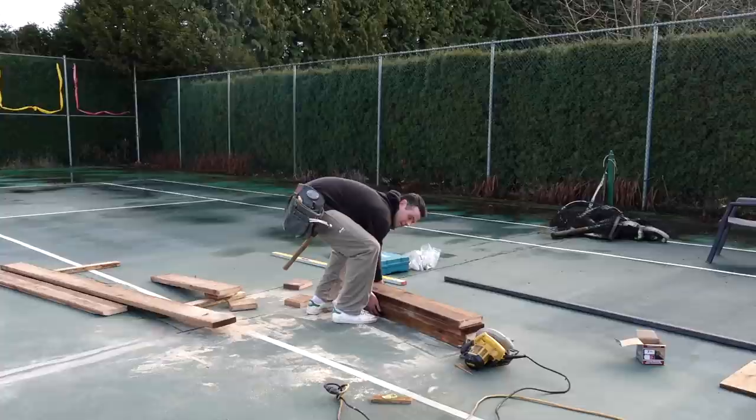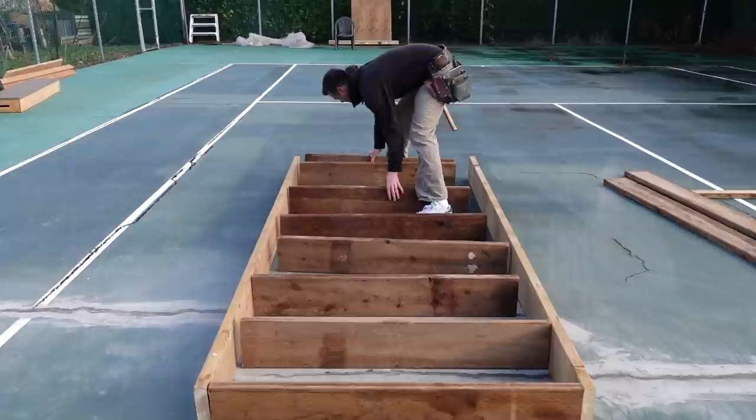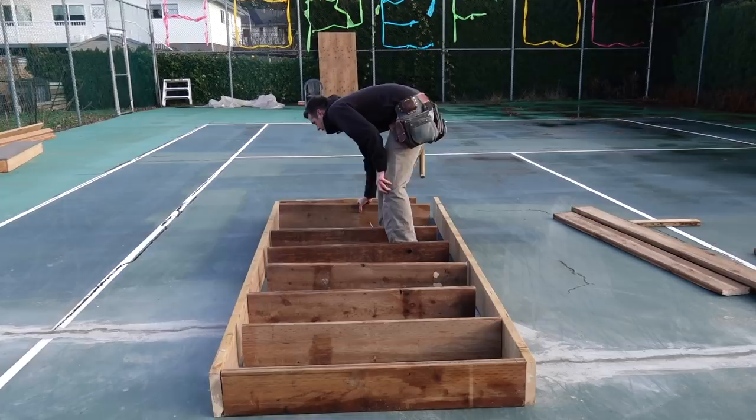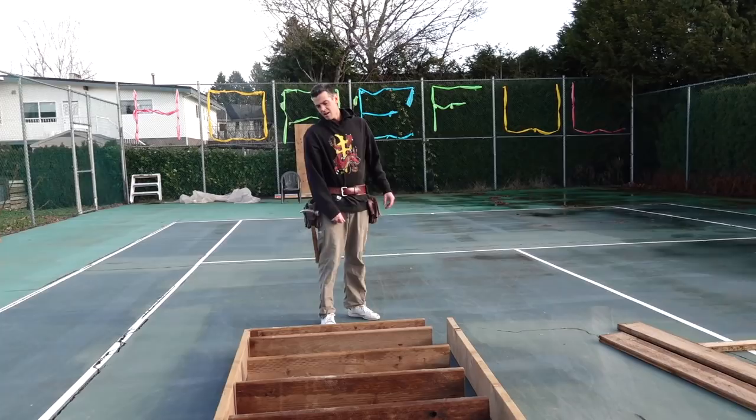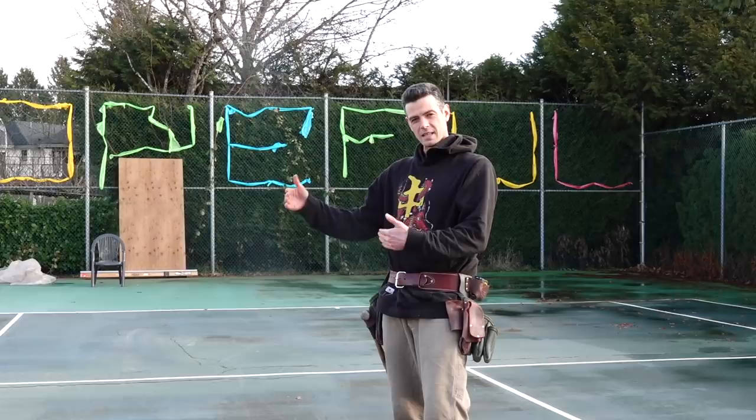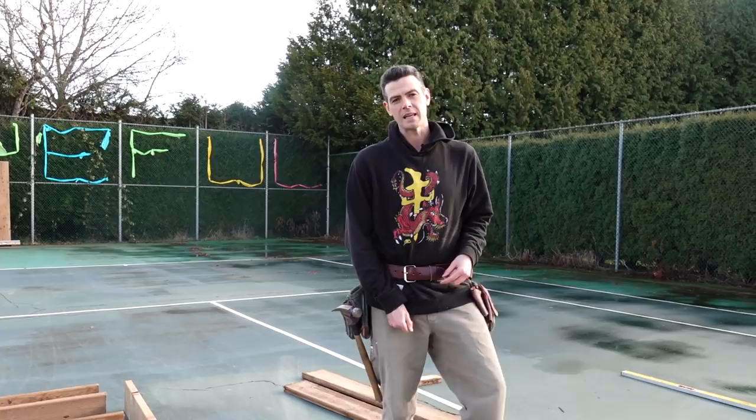The filmer just acknowledged that it's the perfect height box. Now why would I put one that's only about nine inches away there? There's a good reason: because if you want an even-feeling ramp, have an even spacing of framing members. If I have a bigger gap in here, there's more likely going to be a dip right at that one spot where it's missing the framing, compared to the even 16-on-center framing we have here.